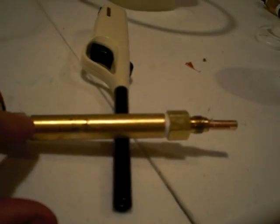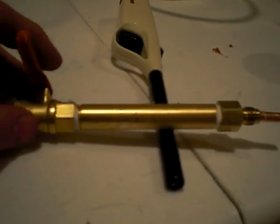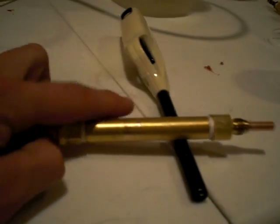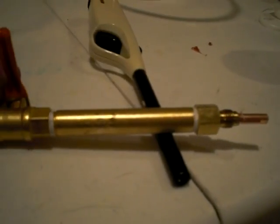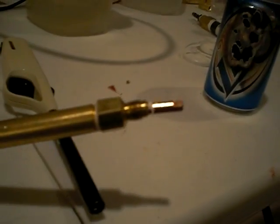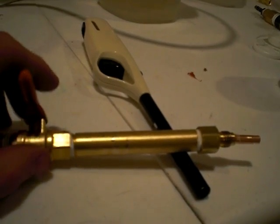I just tapped out that brass fitting and put the tip on. The tip isn't even remotely warm, which I think is the coolest thing in the world. I like this right here — it allows you to shut off your flame. There's bronze wool inside here. I used medium bronze wool because I didn't have any fine bronze wool. This valve is great because if you want to shut your flame down, it's just right there.